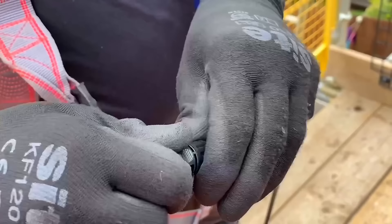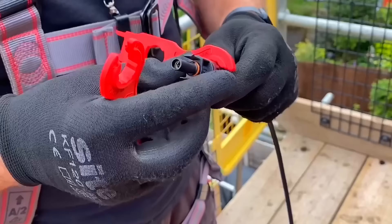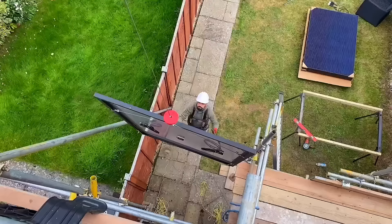And then we've got the spanners, which we use just to make sure — make those off. IP rated? Yes. Even though it's sitting underneath the actual solar panels, it's still going to have a chance of getting wet, so these are specially designed. One's on the back, so you've got grooves which sit on the back of the connector. Then down to the middle and just give it a little twist and wait for the click. That click is a good click — that is tight. So that is properly made off.